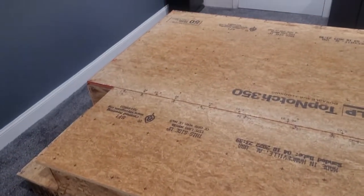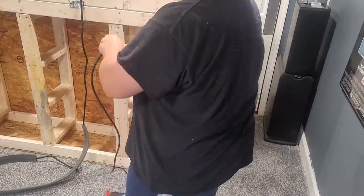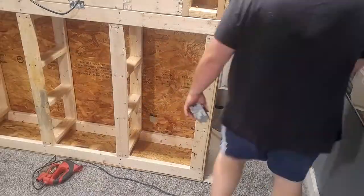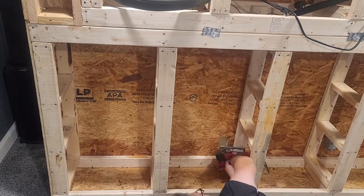We've got that hammered in, and now it's ready to be lifted up on the side. Just need my son's help to do that and we'll get it up and start finishing this wiring. The holes are marked, ready to use our jigsaw to cut those holes. Got to drill a pilot hole with my drill first to get the jigsaw blade in, and we'll cut these and get boxes dropped into them as well as plugs. This time we decided to use the jigsaw instead, which was definitely easier to use. However, it was not as precise, so the boxes weren't fitting as snugly as I wanted — but it still worked perfectly fine. Much easier than using the oscillating tool.